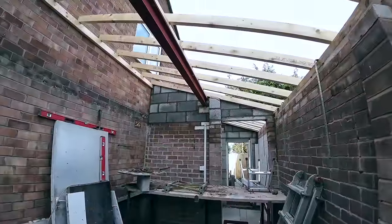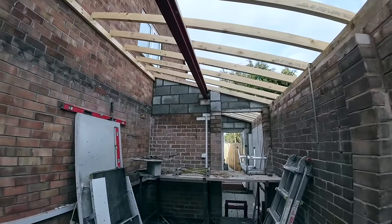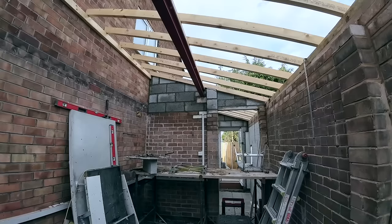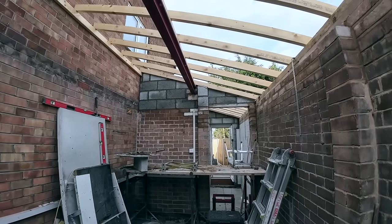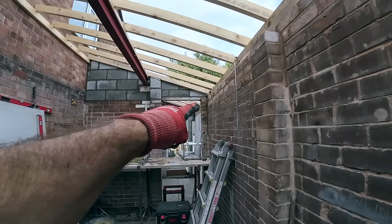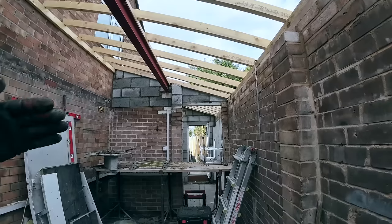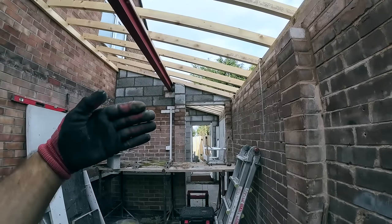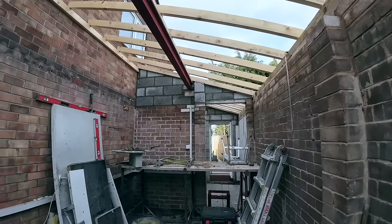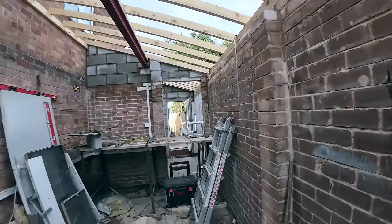There's a ground level view of it. It's only a little half pike, but that was a lot of work. I think the lintel's gone up 3 or 4 courses. And you can see there's a third course down on that side. There's a split in it because it was that far out of level. The wall didn't line up either. We've had to sort of bend that pillar back a bit to make everything line up. Nothing straight in here. That garage wall's wonky.